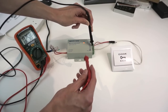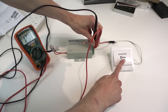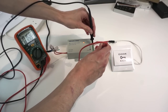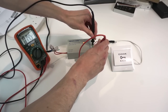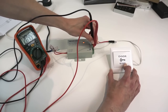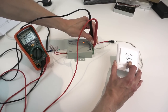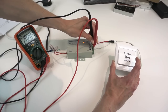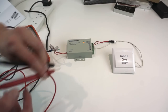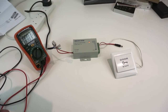If we check the voltage on normally closed and push the door exit button - which is linked between ground and push, and the voltage is about 5 volts for switching - put that on common, that onto normally closed, and see what happens: if you push the exit button the voltage drops down to like a couple of volts, and if you let go of the button it'll sit for a couple of seconds and then jump back up to 12 volts again - that's the time delay.